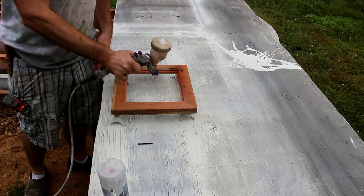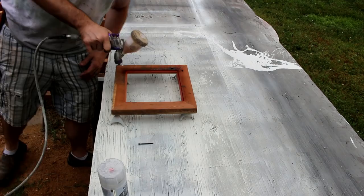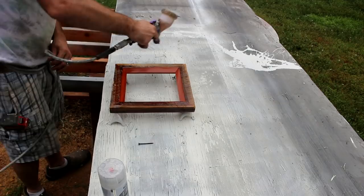The first thing I'm going to do is take these things and apply a nice spray-on coat of flat polyurethane. I want them to still resemble the original barnwood that I started with, but have at least one small layer of protection. So I'm going to spray some premixed thinned polyurethane in flat finish onto the face of these things and let that dry.